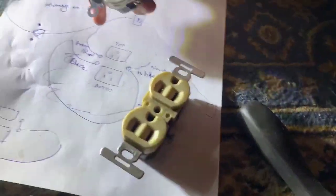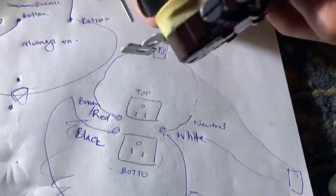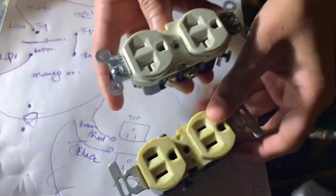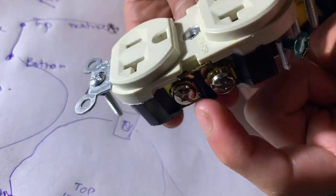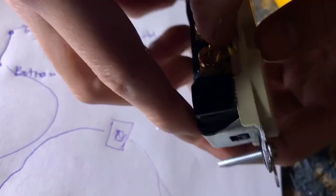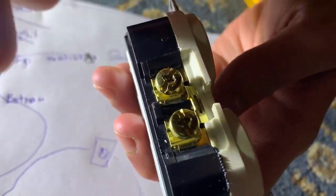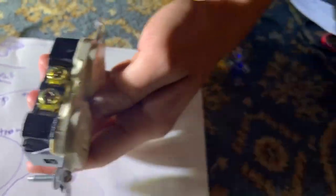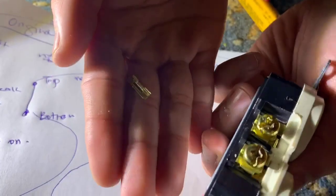Right here we have the new wall outlet and the old wall outlet — just a quick glance at what they look like. When you buy a new wall outlet, you'll see that it comes with both sides of either the neutral side or the live side connected. However, because we want these to be independent of each other, these two wires cannot be connected or they're going to short-circuit. So what you can do is take a screwdriver — we've already done that actually — and just pry out this tab.